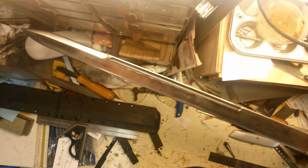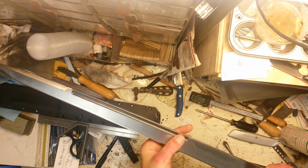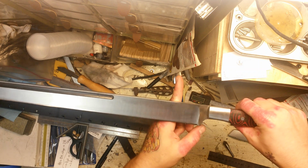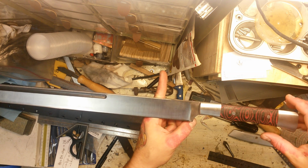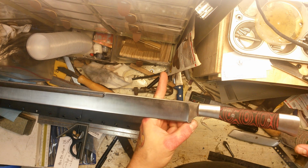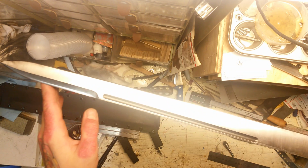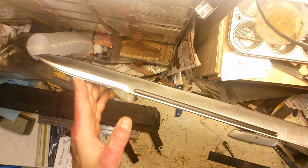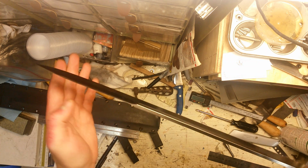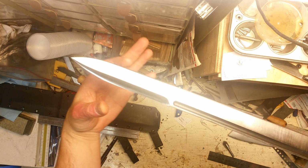It's going to be a decent cutter, and it's got a fuller in there to lighten up the blade a bit. Balance is about 3 inches from the top of the handle. So it's got a nice lively feel in the hand while it still has a good amount of power. The tip has a nice swedge that is sharpened. So it's just got a nasty tip on here.